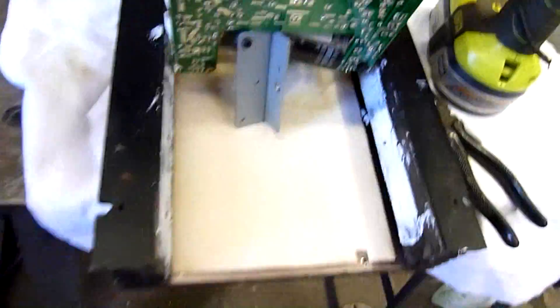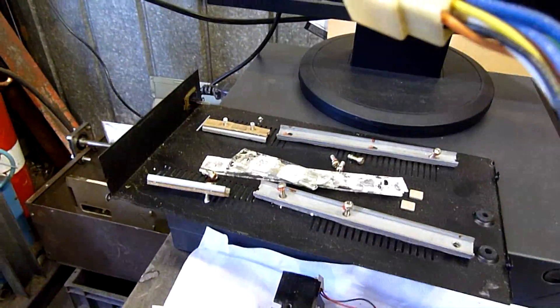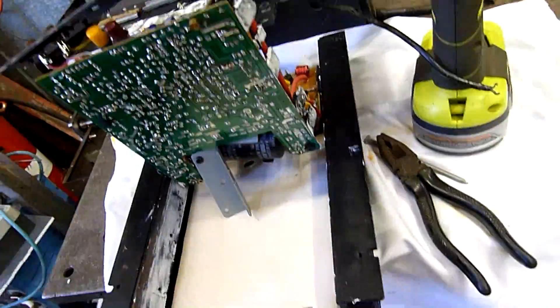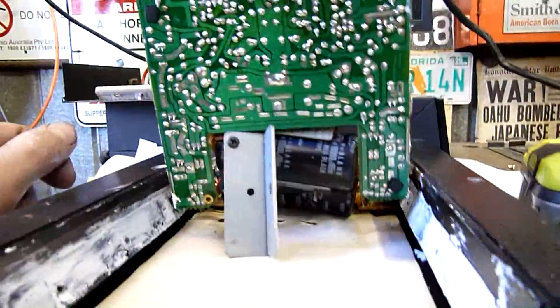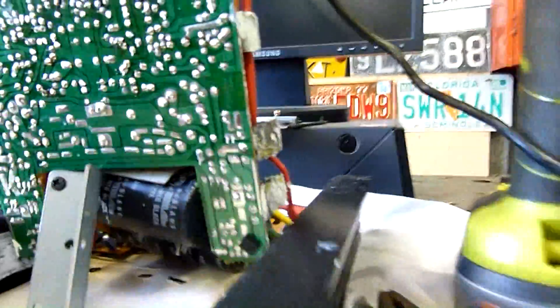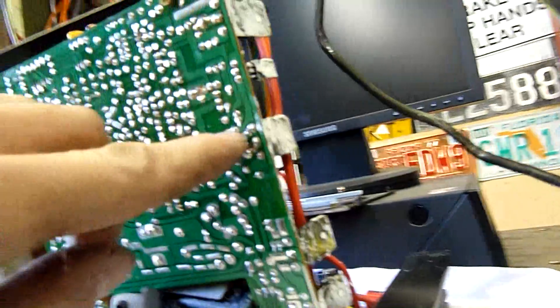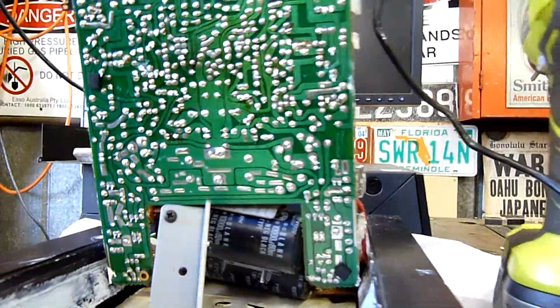It's not pretty, but I've got it out. There's heat sink paste everywhere. I'm going to put new pads on it. The old mica sheet just came apart and flakes, so it's going to get new thermal material if it works. The solder work on this is pretty good. I'm just going to re-solder a few spots - like that pin there is dry-jointed. There's a couple of light spots, particularly on the outputs - that one's dry-jointed as well. I'll change whatever caps I can and just go from there.